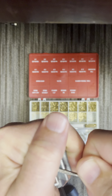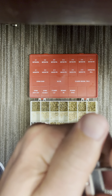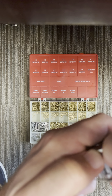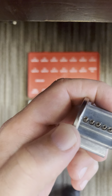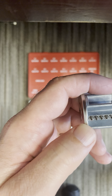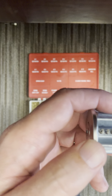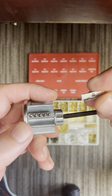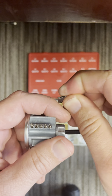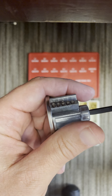Now this rekeying without the key happens a lot to you guys, probably because you're rekeying something that's like the builder ball dropped or something like that. So you just pull that plate up, you pry it up on like one corner over here on a side, pull the plate up, slide it off. Try not to bend it up too much. If you can reuse it, that's great. That one's pretty straight. I normally just give it a little flex with my fingers and kind of push it back to being a little more narrow.